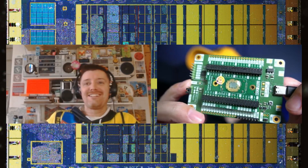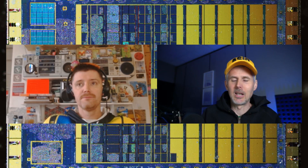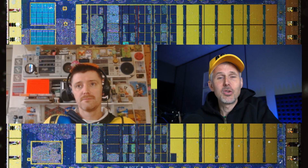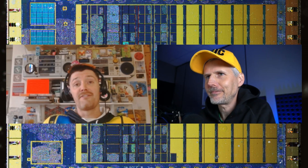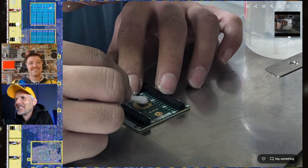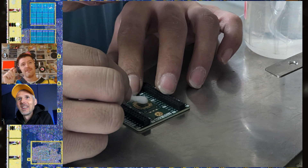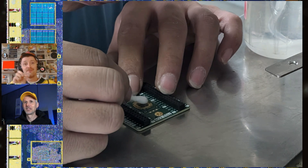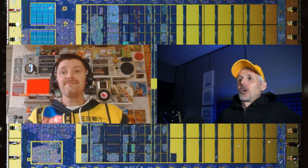After all that work, the result is a board with a little flashing LED showing it's working. It turned out to be the Zero to ASIC Course MPW7 chip rather than Tiny Tapeout 2 — quickly checked! There will be a couple of these chip-on-board assemblies in the Tiny Tapeout shop in the future, along with hats. There's also a great story from a factory visit where someone was picking dies out of a waffle pack with a wet piece of bamboo — using surface tension to lift the ICs — and the chips still worked fine.